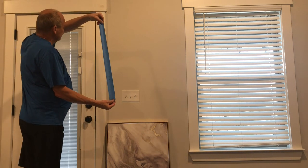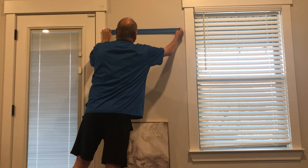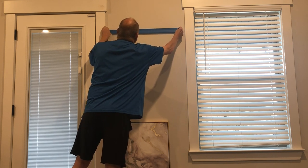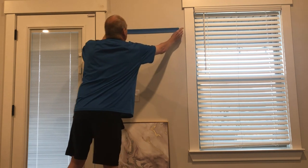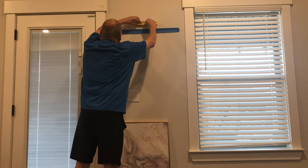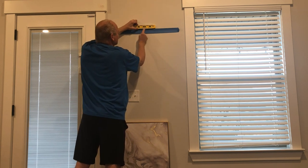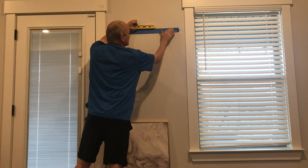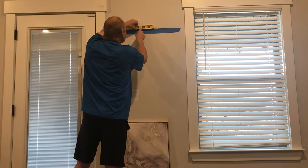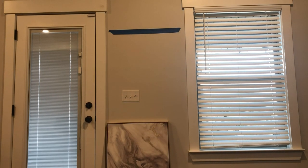Bring your blue tape that you've just marked over to the wall at the marked height for your picture location. Make sure that it's level by using your hand level on the tape, aligning to the center line of that blue tape and the center line of where your picture will hang. Adjust the tape if needed to make sure it's level all the way across. Once it's on the wall and level, make sure the ends are attached to the wall — it's going to be loose in the middle. Then locate those two spots and we're going to hang our mounting hardware.